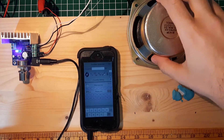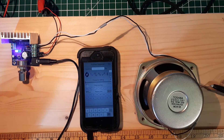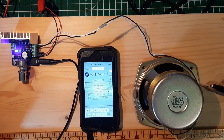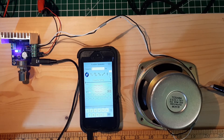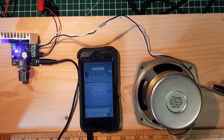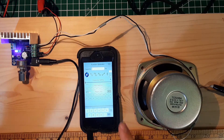I hope this doesn't get too messy. I have two more phones here to place the speaker, hopefully always at the same spot. We'll go from 30 Hz up to 80 Hz and compare the frequency response of each microphone in the low frequency range. And because it's science, I know probably all of these piezos are pretty unique and have some distortion, harmonics, and natural resonance. In the next episode, I'll stack them to my guitar and play the same chord progression, then compare the small, medium, and large piezo discs.